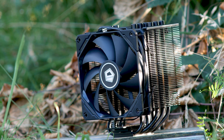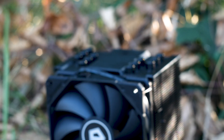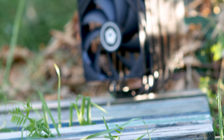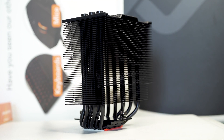From a design perspective, this is a good-looking CPU cooler. It has no less than 6 heatpipes and aluminum-made cooling fins to dissipate the heat of the CPU. The top of the heatsink is covered by a metal decorative plate and the heatpipe ends are covered by metal caps. This CPU cooler also has an offset design to push the entire heatsink and fan assembly away from the RAM slots of the motherboard, thus increasing RAM clearance and compatibility.